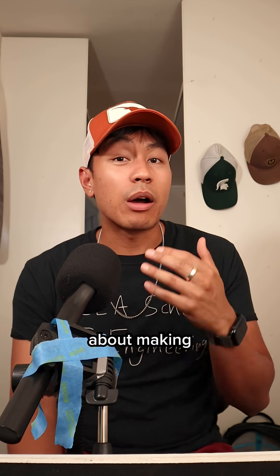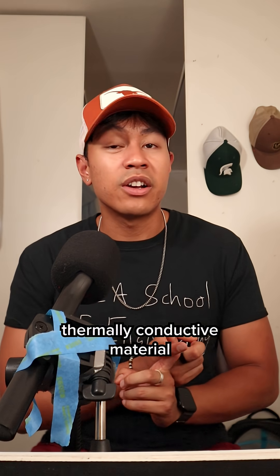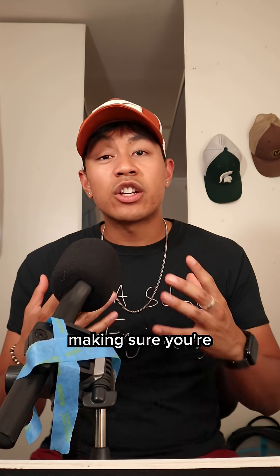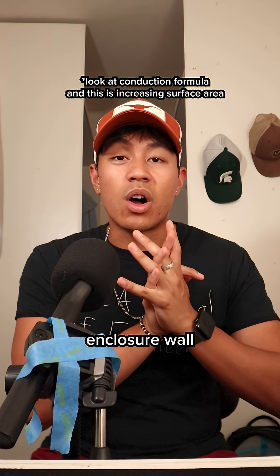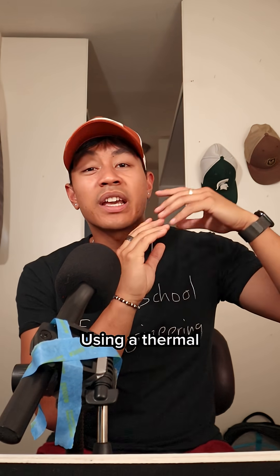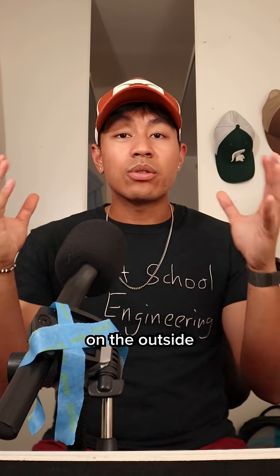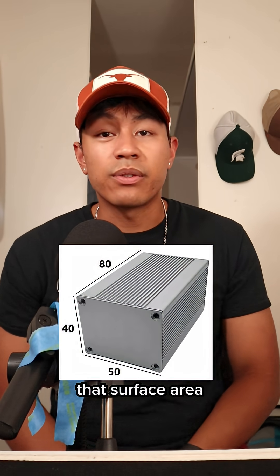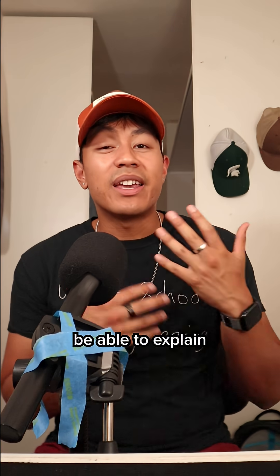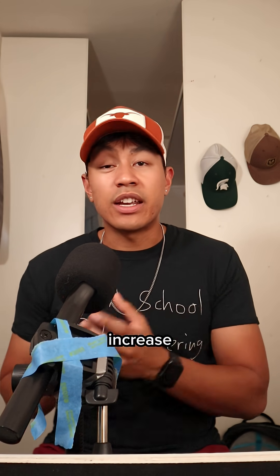They kind of want to hear you talk about making a heat exchanger. Some design considerations: your enclosure being a thermally conductive material such as metal over plastic, making sure you're maximizing the contact between your PCB and your enclosure wall to induce the most conduction, using a thermal pad as a heat sink between your PCB and your enclosure wall, and on the outside of your enclosure designing ribs or fins to maximize surface area for convection. Be able to explain at a first principles level why your design changes increase heat transfer.